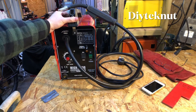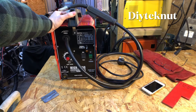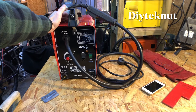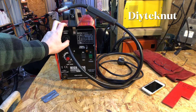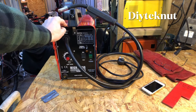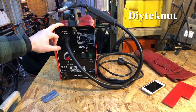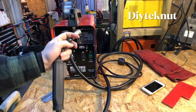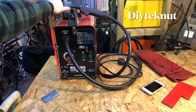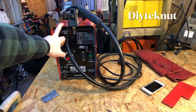Conclusion on this welder: it's not really for sheet steel. If you're thinking of doing car bodywork, I wouldn't even consider it - you'd have to be on the tightest of tight budgets. These are selling for £130 now and I think that's really overpriced for this machine - it's not worth £130. If you can get it for under £100 maybe, but it's kind of false economy because it does one process and that's all, and you're stuck with flux core wire. Then you might want to upgrade in a few months' time.